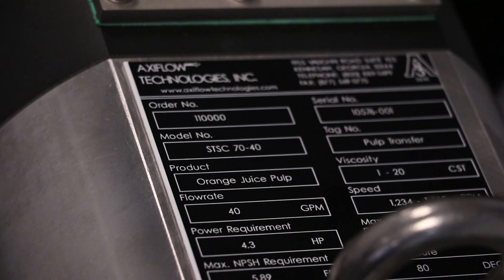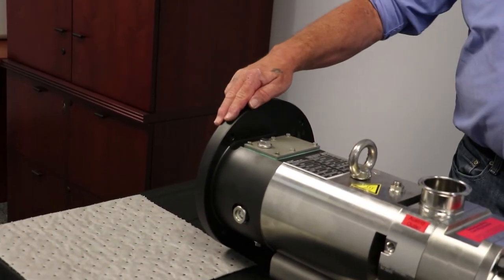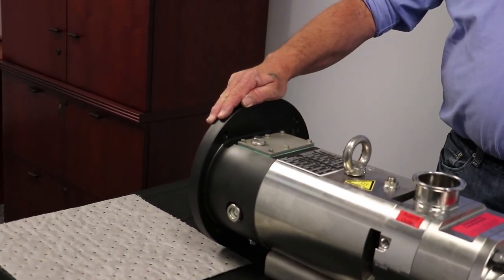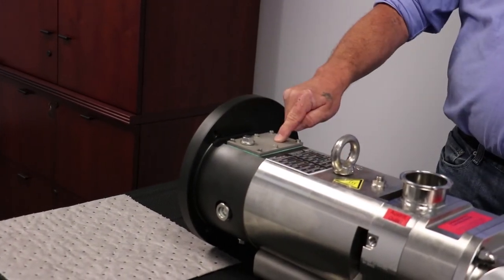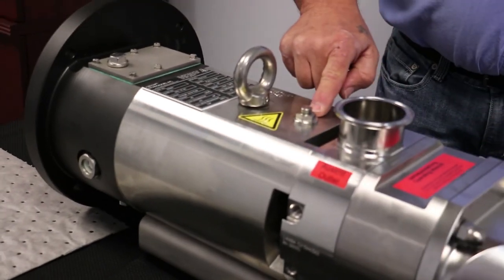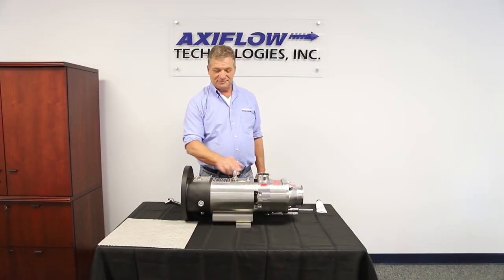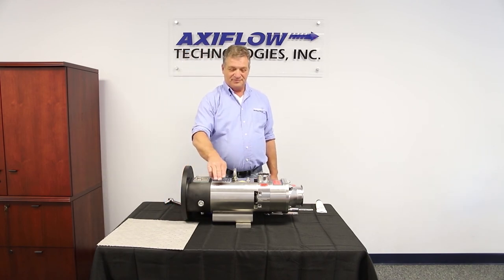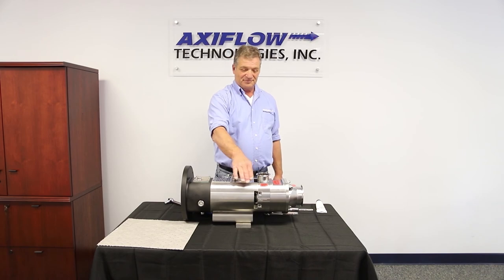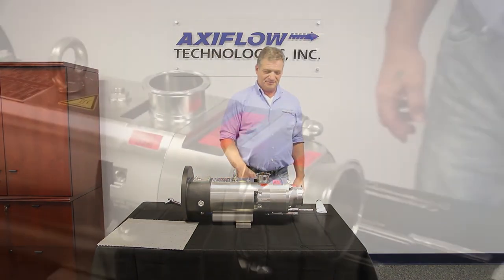Here is an overall description of the pump. Starting at the back of the pump is the gear cover, which can be either Teflon coated aluminum or stainless steel. Located on the gear cover is the timing gear access cover, oil level sight glass, oil breather, and drain plug. The bearing housing contains three angled ball bearings, a bearing spacer, and one needle bearing on each shaft.